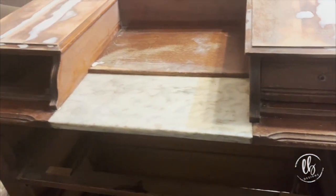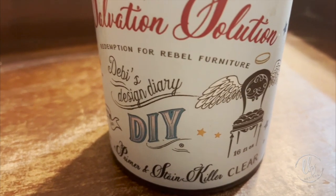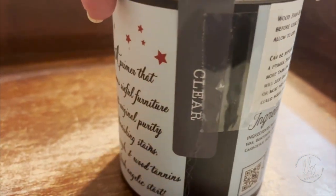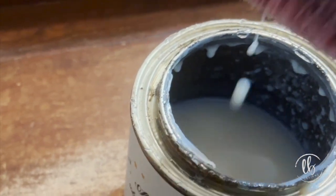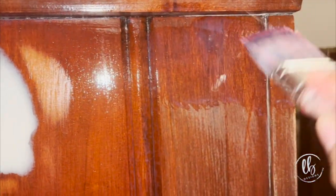I sanded down the Bondo and scuff-sanded the sides because they were really, really glossy. I pulled out the vinegar water solution and cleaned it again. I decided to use Salvation Solution because I'm using milk paint and the sides were awfully glossy. There was also a little bit of residue coming up so I figured I should prime it. This primer is very liquidy and I wanted to go over the Bondo to make sure it was well primed. I did two coats of the Salvation Solution while my dogs slept and played all around me.